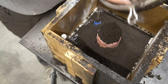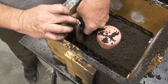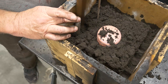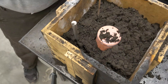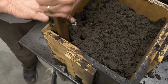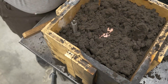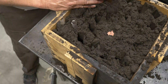The idea here is so I can get my bell pattern, my gate pattern, and the sprue oriented properly so when I start filling in the cope everything's going to be in the right place. You'll see me later take the cope off and redo the drag - I'll be able to lay that runner right back where it was and everything will be aligned nice and neat. I'm filling the cope in sections - partially full, ramming it down, filling it again, ramming it down. I found that the first time I rammed this thing up I didn't have a really good ram job and I had a lot of creases in the sand that showed up in the surface of the bell.